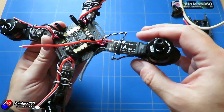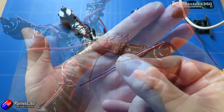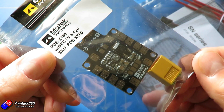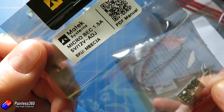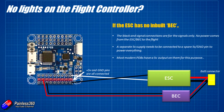The good news is most power distribution boards these days — the part of the model connected to the battery where the power connections from the ESCs also connect — will have a little 5 volt regulator on there that you can use to power the flight controller. Alternatively, you can get very small thumbnail-sized battery eliminator circuits that will supply about 1 to 1.5 amps at 5 volts, which is more than enough. All you need to do is connect the power side of the little battery eliminator circuit to a spare positive and negative battery terminal on your power distribution board, then connect the 5 volt output onto any spare 5 volt and ground pin on the flight controller.